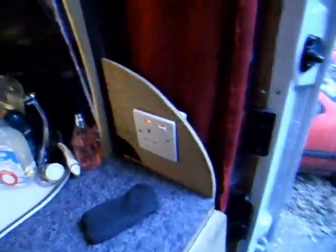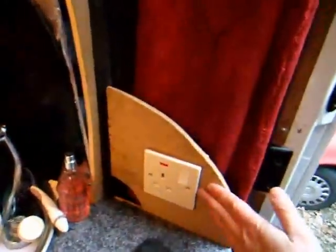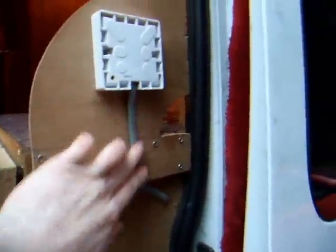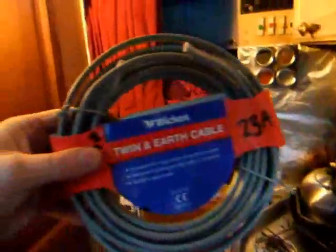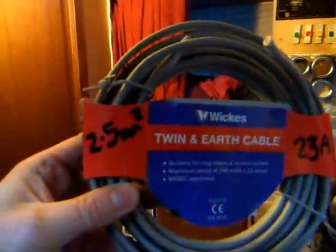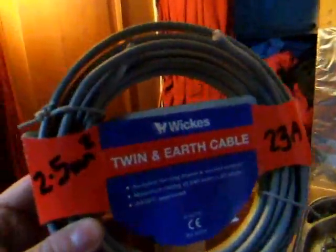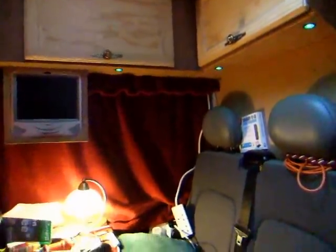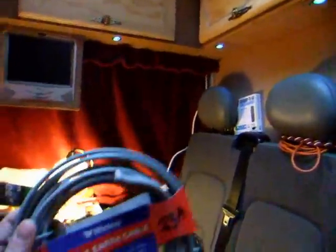And I've got another socket here I've fitted — that's very useful for kitchen appliances, especially when you put out the extra work surface with a little microwave on there or something. It's all on the same sort of grey cable, and incidentally you have to use the right sort of cable. This is what I've used: Wickes two-and-a-half millimetres squared twin-earth ring main cable, 23 amp. A good rule of thumb is one millimetre squared will take about 10 amps, so two-and-a-half gives you 23 amps — more than enough, and much bigger than the residual current device. I think that's a 16 amp supply, much bigger than any of the fuses.